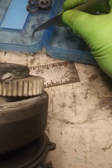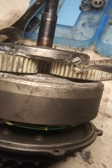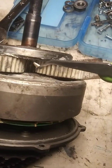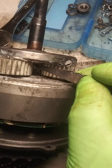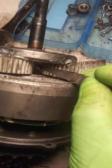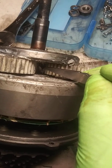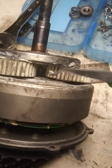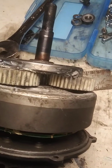So I came inside and took a look — and what I found were little bitty pieces of teeth from one or two of the three planetary gears, caught in the center gear, causing a major balance problem. Every time a gear would knock over a fragment, it would create distance, pushing the gear back, creating vibration and that knocking sound.